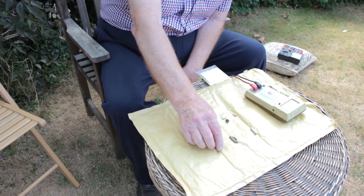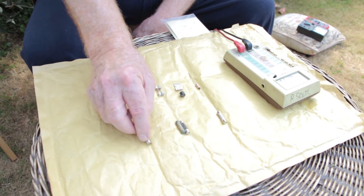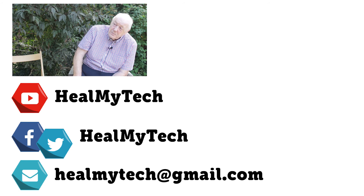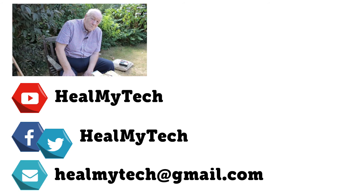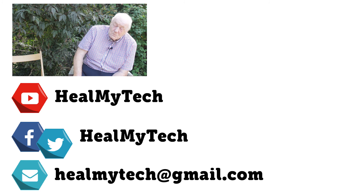A pack of fuses is not expensive — on eBay, a pound or two. You should always keep a few around. For 13 amp fuses especially, always buy a proprietary brand like MK. Some foreign-made fuses may not be as accurate, but with a high-current fuse buy a proprietary brand. Cheap doesn't necessarily save your money. Thank you to Alvin for his expertise — hopefully we'll see him more on the channel.